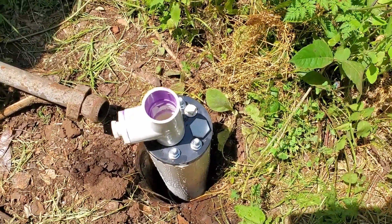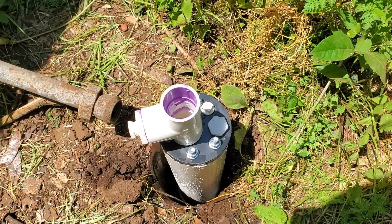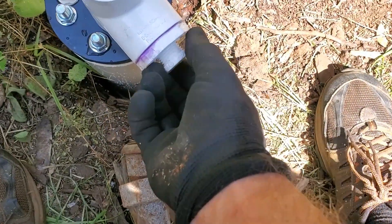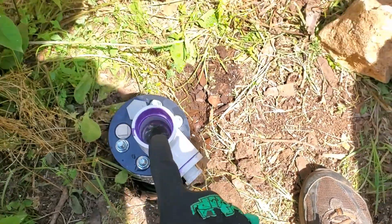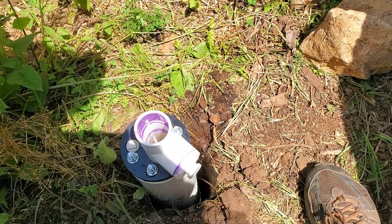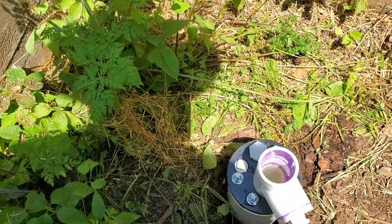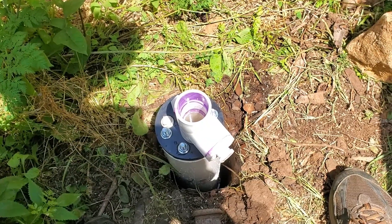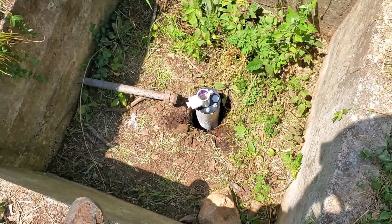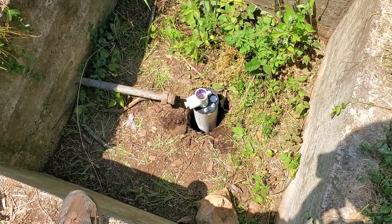All right, what we have right now — we have our cap on there, it's all tightened down, so there's pressure squishing on that four-inch pipe, and there's also pressure squishing in on the one-and-a-quarter-inch pipe, locking it in place — so this is not moving. And then there's my drain, my winter drain. So in wintertime I can pop this off, it'll drain the pipe from here up to the pitcher pump so it doesn't freeze and crack. On warm days we can always plug it back up. I'll also need to get in here and kill all this poison ivy and then pour some pea gravel or quarter-inch chip in here. And although it may seem like putting that packer in was a waste of time because we only got it down about 13 feet, it seals off the top — so anything that falls down that hole now will not go into the well; it'll hit that packer and get stuck and won't go any farther.